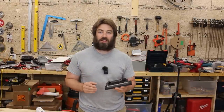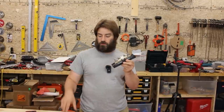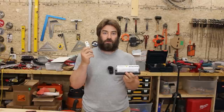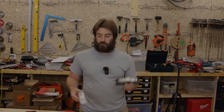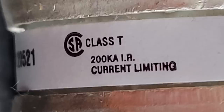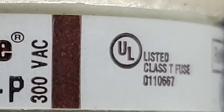Over on the workbench there's a little work to do on the bus bar before installing it. I was able to get the fuse holder with the fuse and plastic cover for the same price as just one single fuse from a different seller — due to supply shortages the price of fuses has really skyrocketed. I'll leave a link in the description. This is a 300 amp fuse rated for both AC and DC. The spec sheet shows 20,000 amps DC interrupting rating at 125 volts DC — that is a beefy fuse setup.